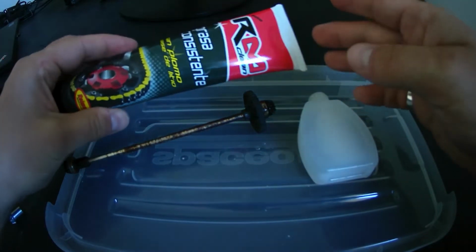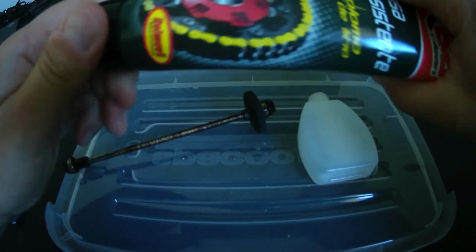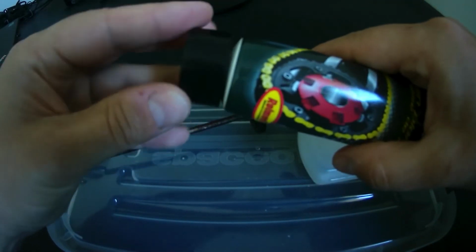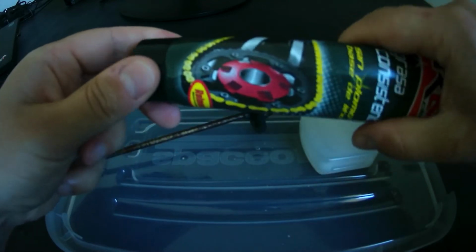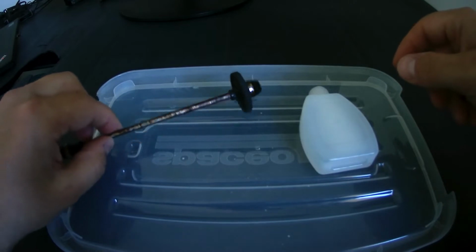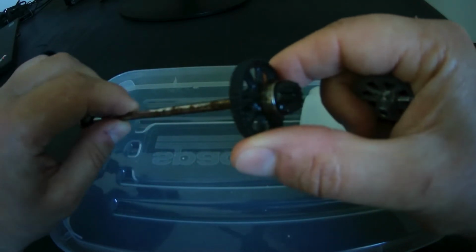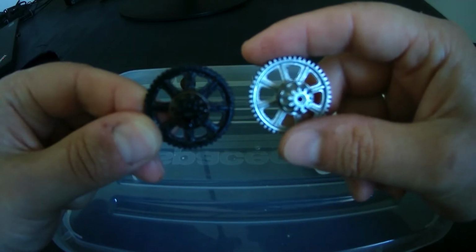So I used a lithium grease like this, which looks like silicone grease, and I actually thought maybe it was that type of grease with silicone, but it wasn't. It turns out that all grease types except silicone grease can damage rubber, and probably it can damage plastic. In my case I had this shaft with a plastic gear, and I think that one of the reasons why it got quickly worn out was due to using this type of grease, non-silicone grease.